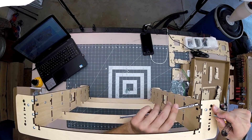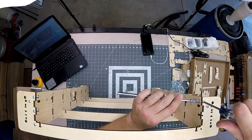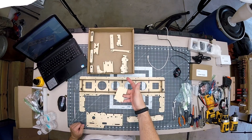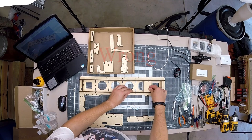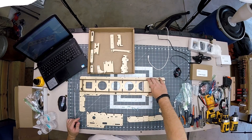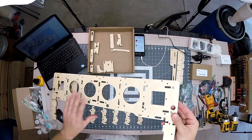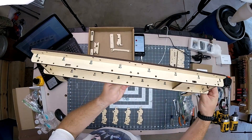The magnet tool was working so well I wanted to show you a close-up of what it looked like. The directions say to take these screws up to snug and then one and a half to two turns past that. This little piece of wood was accidentally put in upside down — it holds the controller and you zip tie to it. The two little holes need to be at the bottom of the gantry instead of the top like I did.